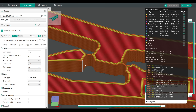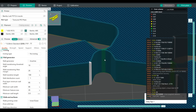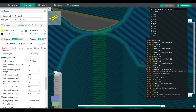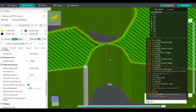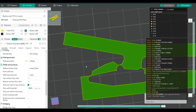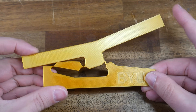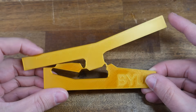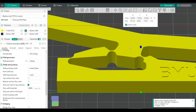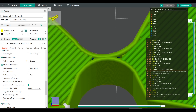You need to double-check that the junction has consistent extrusions. On a similar note, Arachne perimeters may be problematic. With Arachne on, previewing by line width shows variation across the junction. Switching to Classic and re-slicing reveals that some sections were too thin for extrusion to actually take place — Arachne hides this but makes for a weaker joint. The first time you actuate such a mechanism, you may hear a small crack and have a partial failure. To get around this, if it's someone else's model, the simplest fix is to scale it up, which should give the junction enough width for full-width extrusions and a reliable mechanism.